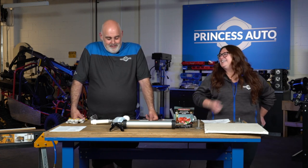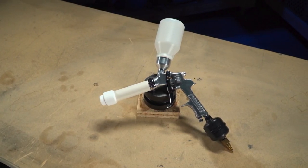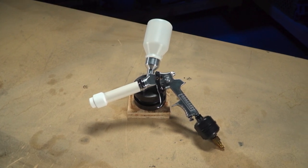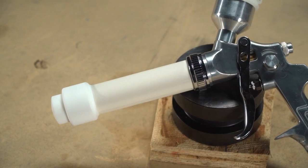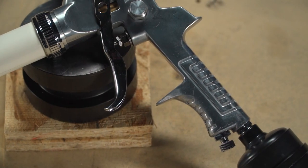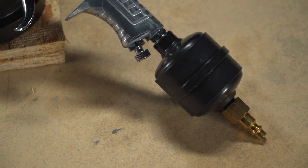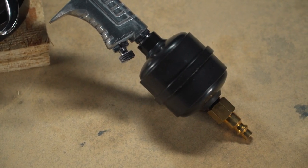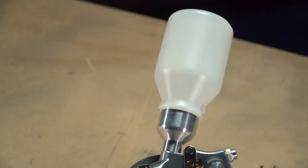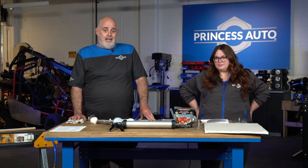What are we hitting first, Derek? Well, I think the first thing we're going to look at is one of my picks — it is one of our PowerFist powder coating guns. Very straightforward gun, no other attachments other than a nice little air filter on it, and there's a ground strap to ground the part. Any compressor will run this. The higher the CFM the better. We sell a nice little tabletop oven that gets up to about 440 degrees, perfect for small parts.